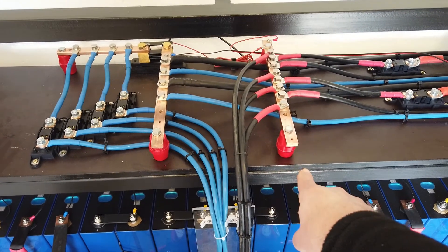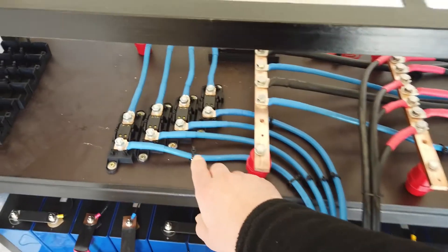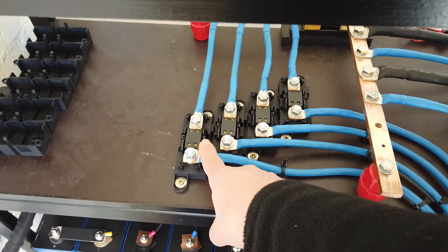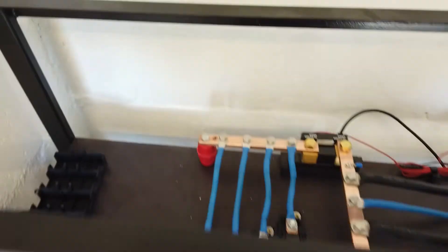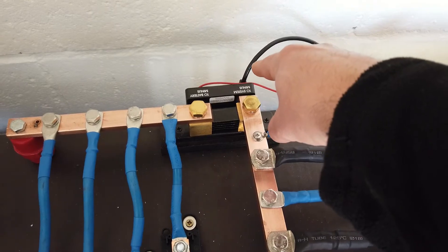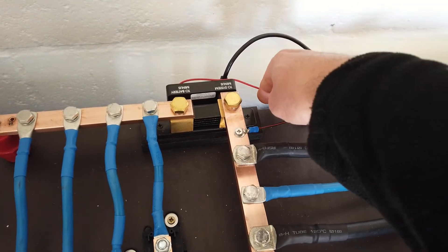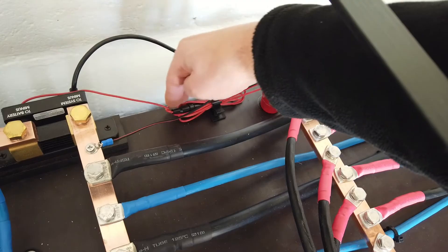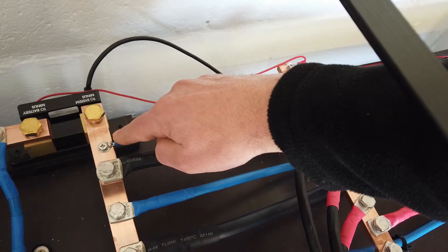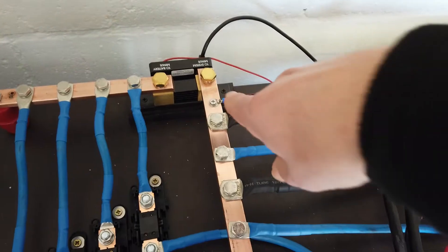On the power distribution shelf we have two bus bars: the positive and the negative. The negative cables from each battery go through a 120-amp fuse to a small bus bar, then through the Victron 500-amp shunt — which should be more than enough. A cable from the shunt goes to the Cerbo. There is also a power cable with an inline fuse delivered to the shunt. If you make bus bars, make sure to foresee an M4 thread to attach the cable — I have a specific video on how to make these bus bars.